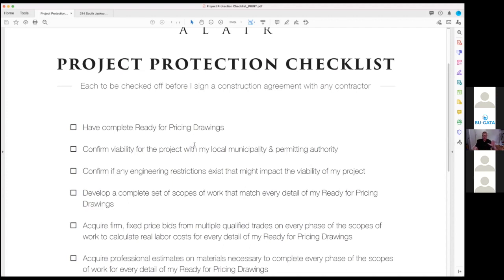So as we're doing those drawings, you want to work closely with somebody who is actually going to build that thing and has a relationship to cost. When you're working with an architect or a designer or a draftsman, once they go into permit drawings, it becomes a large scale pain in the butt to change those drawings. So if you can get to floor plans and elevations, which many architects will call a bid set, you can get about 80% of the cost pretty well nailed down if you want to. And you can certainly lessen that range quite a bit.